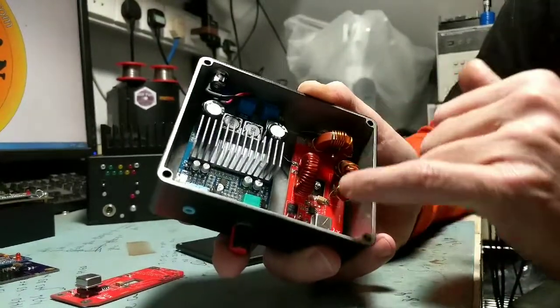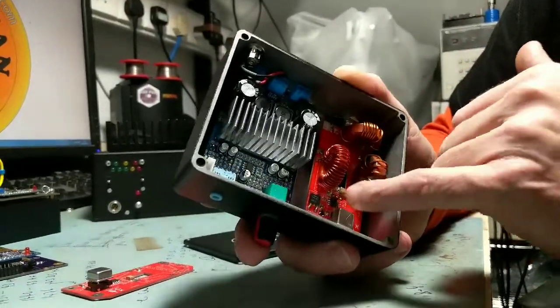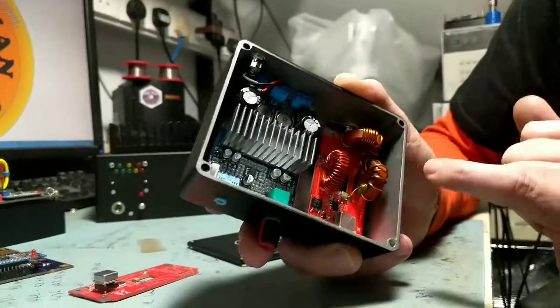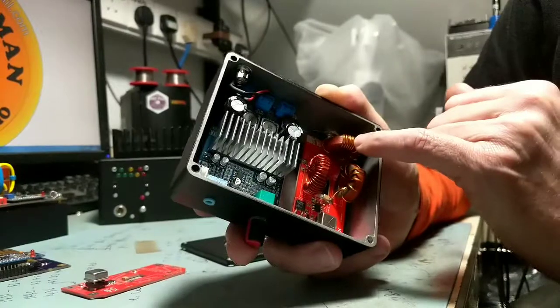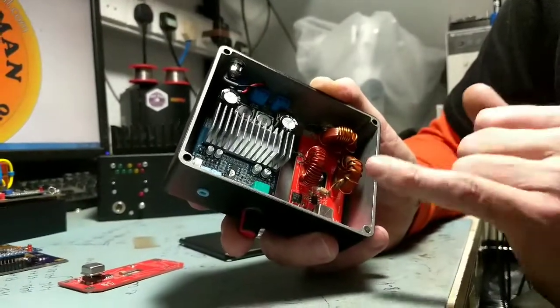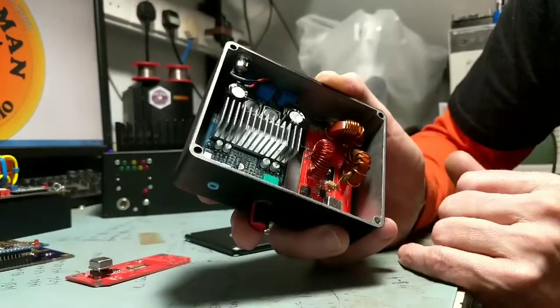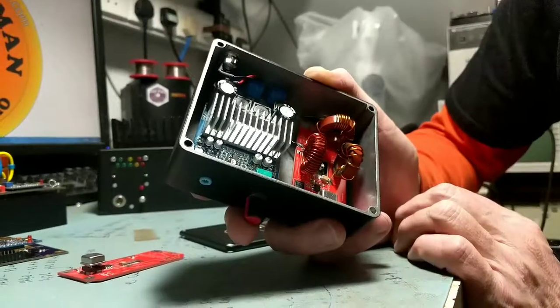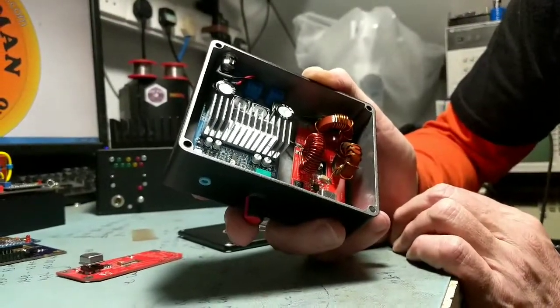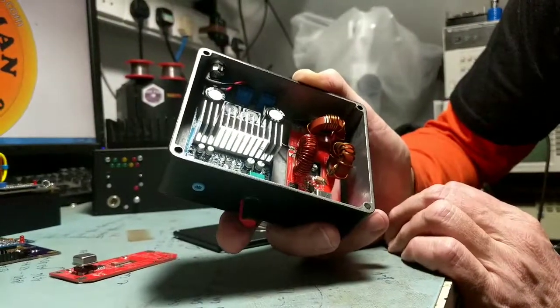So you've seen the board, and these are the inductors now. There's the FET running in Class E down there, nice and efficient. This is an elliptical filter. It's got a notch at the second harmonic, so it will notch out the highest level harmonic, which is the second in a single-ended design such as this. And the harmonics are very low, and certainly should pass any qualification.